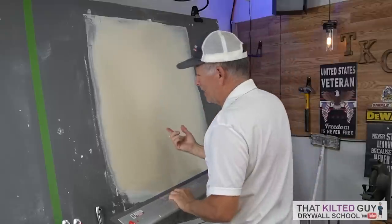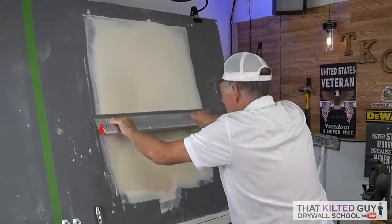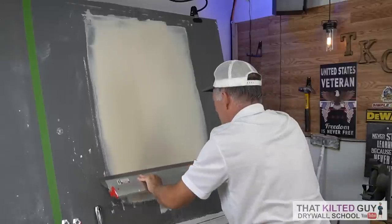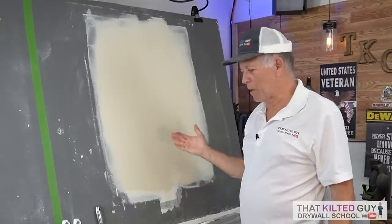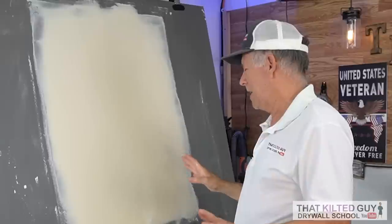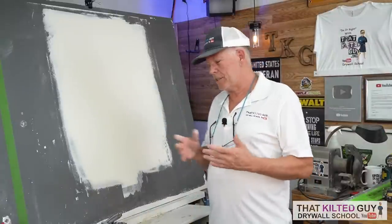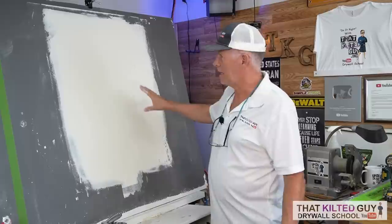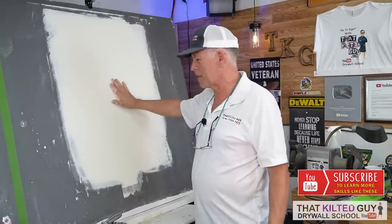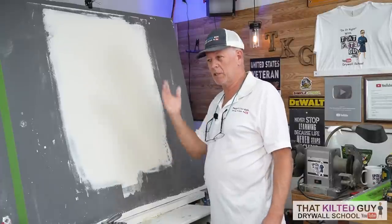Sometimes you want to go over it a couple of times. I let this sit for three or four minutes while setting up a GoPro so it probably thickened up a little. I made several passes - partly from walking off hunting down GoPro stuff. It's got a few bubbles and one little void we can fix. I actually screwed this up - I let it sit way too long messing with the GoPro and it got real draggy, so I'm just going to do a skim coat with this blade to clean it up, let it dry, then check the side lighting.